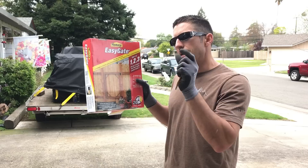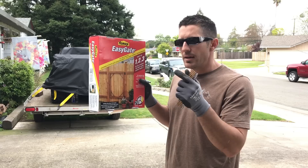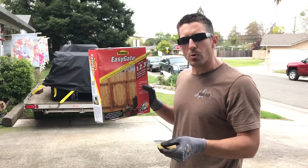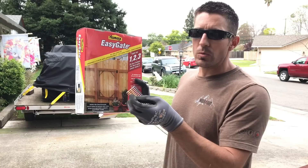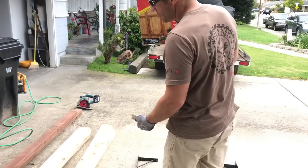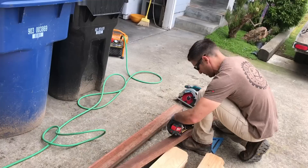You can use galvanized staples, but if you have a dog you want something a little stronger because they could push the boards out. You can also use exterior screws. These ring shanks are going to suck in tight — they have little ribs on them and once they go in they're really hard to pull out, so that's what we're going to use to fasten our pickets to our boards.